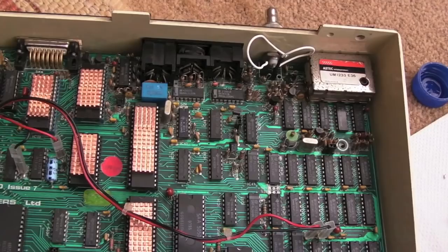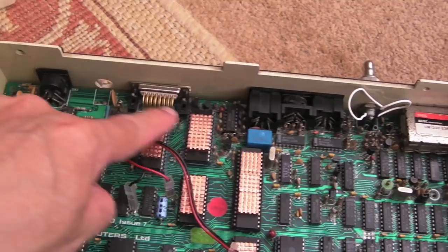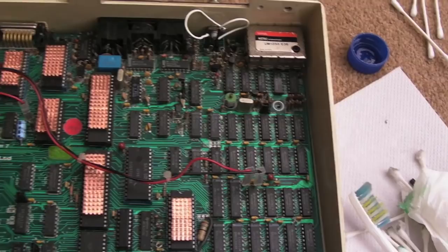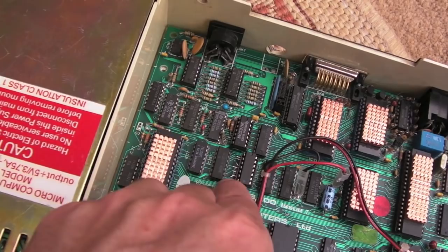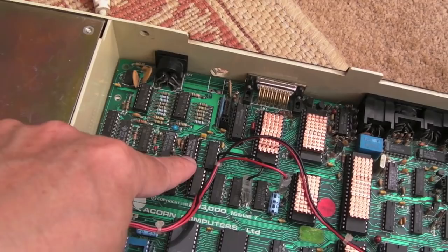The board is fairly clean now — the difficult parts are the areas with packed resistor networks. Be careful using a brush there as you don't want to bend diodes or resistors into contact with each other. Where I replaced a chip I used flux and desoldering braid on the top side, which just removed the solder mask leaving silver traces but no damage. There was one damaged trace under the 74LS04 from being a bit impatient, but I put a small patch wire underneath — a dead short, nothing really visible.